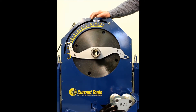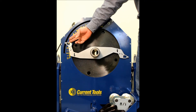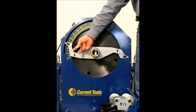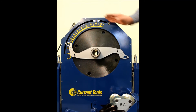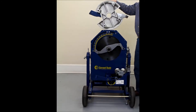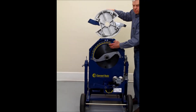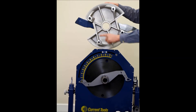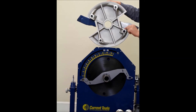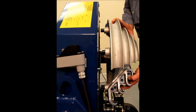Before mounting the shoe, be sure to rotate the end of the pointer to correspond with the shoe you have chosen. In this instance, we will be using the pointer that corresponds to the half to one-and-a-quarter inch shoe. If we had chosen the inch and a half to two inch shoe, we would use the other pointer rotated to that side. Now that we've selected the shoe for the conduit we'll be bending, it's time to mount the shoe onto the bender. The sprocket has two holes that are larger than the other two, and the back of the shoe has corresponding studs, so there are only two ways the shoe can fit on the bender. Install the shoe onto the bender.